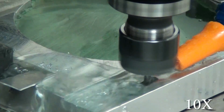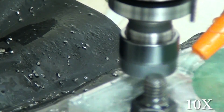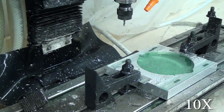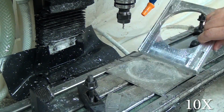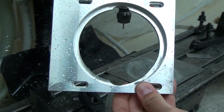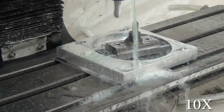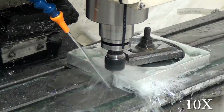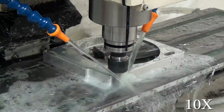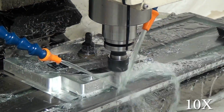You'll also notice there are long slots running the entire length of the plate. This is on the bottom side. The idea for those was to allow the plate to actually sit over the standoffs a little bit, which would act as guides. That's not in the drawing because it's not necessary. The slots themselves will keep the plate more or less aligned. If you need to tap it into perfect alignment after you put tension on it because you care that much, then so be it. If you want to machine runner slots for the standoffs, go ahead, but they're not going to be in my drawing.